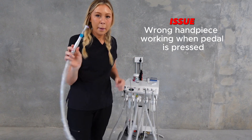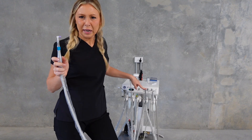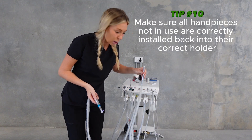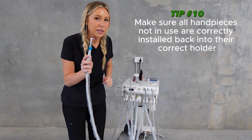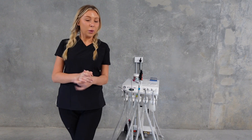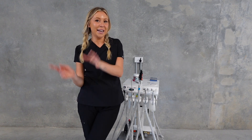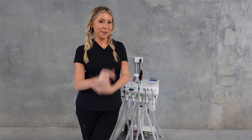One other issue I experienced just now - if you pick up your polishing head and put your foot on the pedal but the high-speed one starts drilling, it's because the handpiece hasn't been installed back into its handle appropriately. Make sure it's nice and stuck and then the correct component will work properly. If you've got other questions about the dental machine or any other equipment-based videos you'd like to see, put them in the comments and subscribe to see all the other videos we're making.